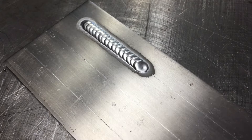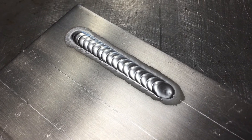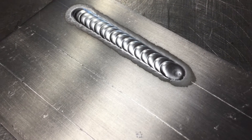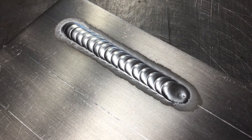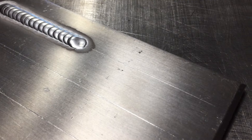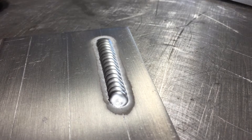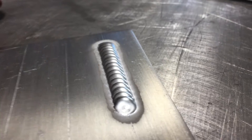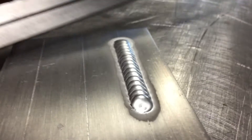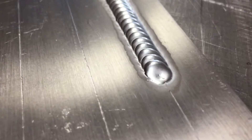Let's take a look at the first half. Everything looks pretty clean for the most part. The weld is relatively shiny, which is good — it shows my balance has worked out to where it needs to be. I did notice a little bit of contaminant coming out of the scribe line, so perhaps I could have scrubbed that a little harder, but it burns off. I tried to keep it relatively the same width the whole way down. You can also watch the reinforcement height, which is about the same the whole way, meaning the fill I put in was adequate and consistent from start to finish.